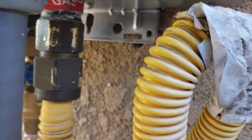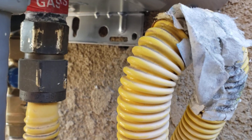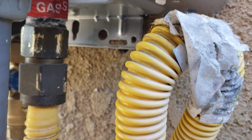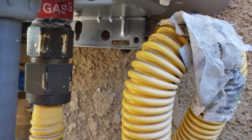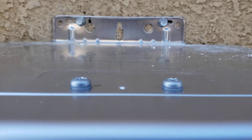One thing we did notice down below: there's no wood backing in the wall, so the screws holding the other unit in place were just floating in there. We didn't put them back in, but it's not vibrating. Everything's real tight against the wall because of the hard pipe, and then these two screws did hit backing, so that's good.